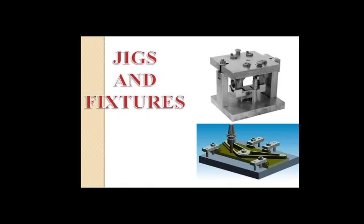It contains 94.8% copper, 5% tin, and 0.2% phosphorus, as it is widely used for replaceable nuts. It provides better corrosion resistance.